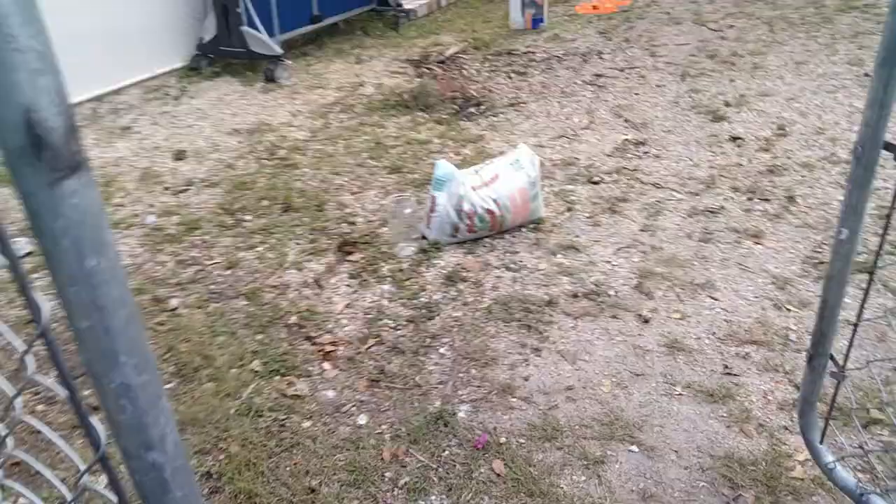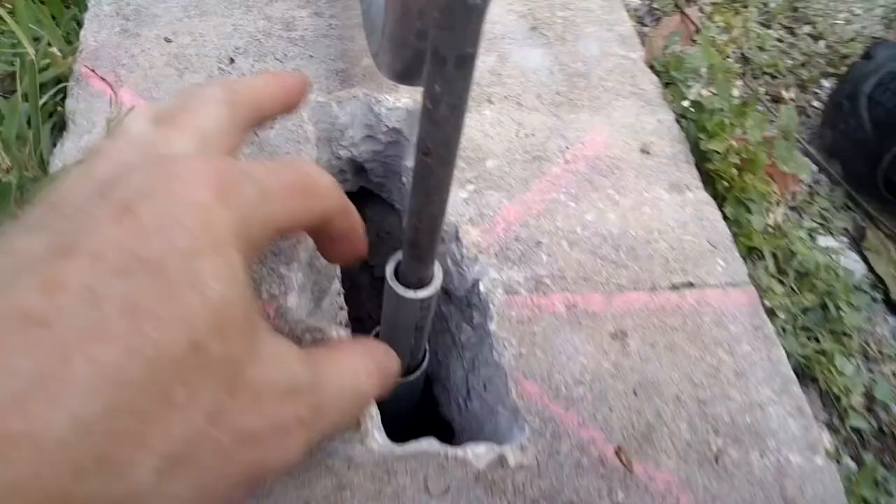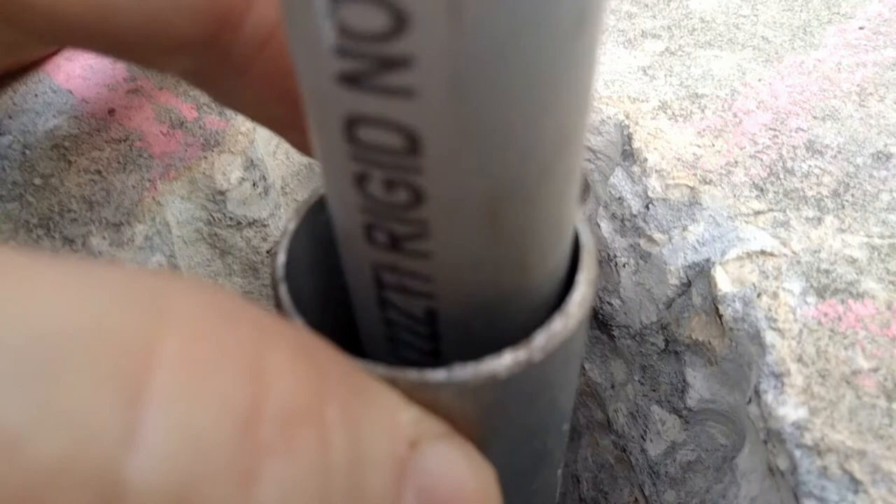Now on to filling up this hole. There's my drop pin. I've got this held all the way up so I know it's going to drop perfectly all the way down. Perhaps the main secret to this is to have the first hole above grade — maybe an inch, half inch. That way crap won't run from the driveway into the metal pole. Being elevated keeps crap from falling in there.